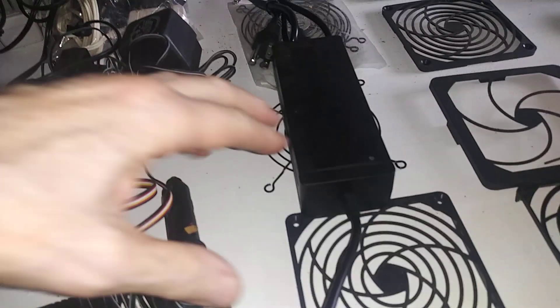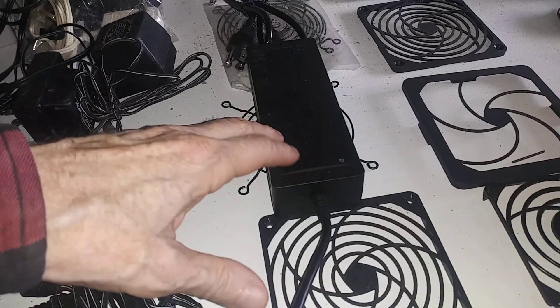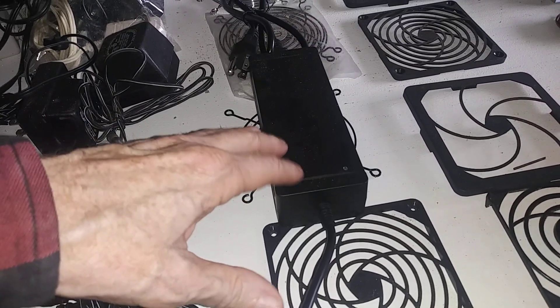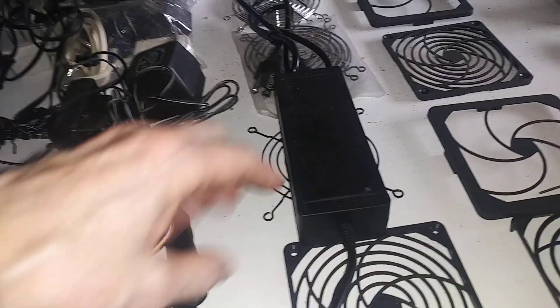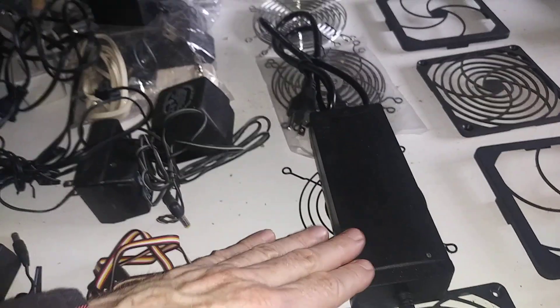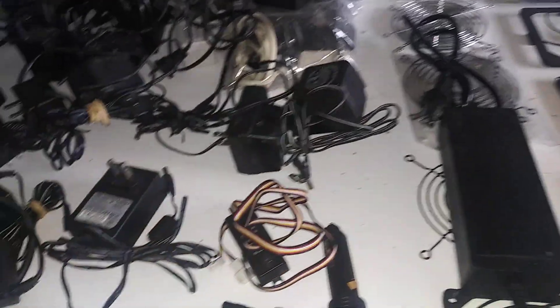Your laptop runs on 18 volts or 12 volts — the newer ones run on 18 or 16, the older ones could run off 12. So you have to be careful: if you buy one of these and it's 18 volts, you might burn something up. Make sure it's 12 volts or below, as long as your fan or water pump are also 12 volts.